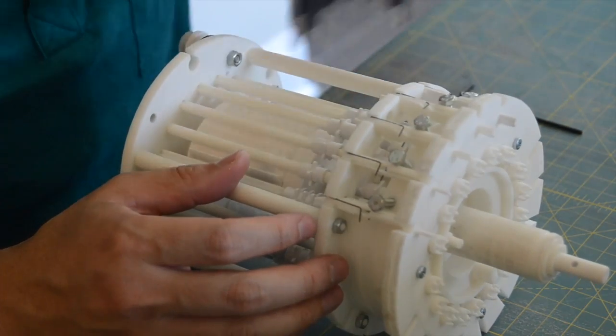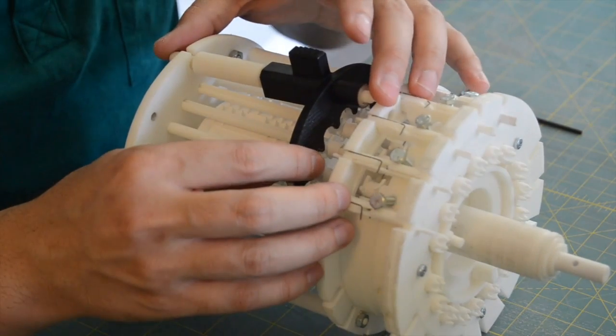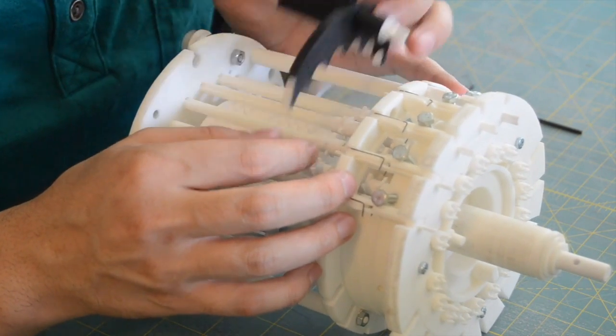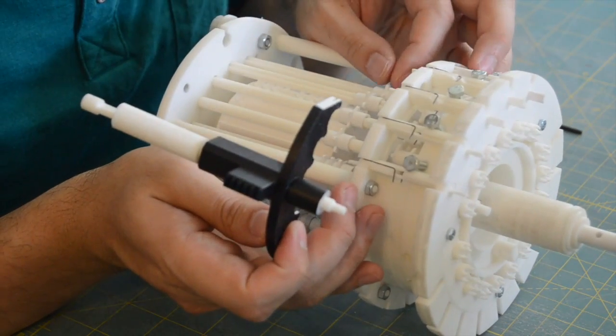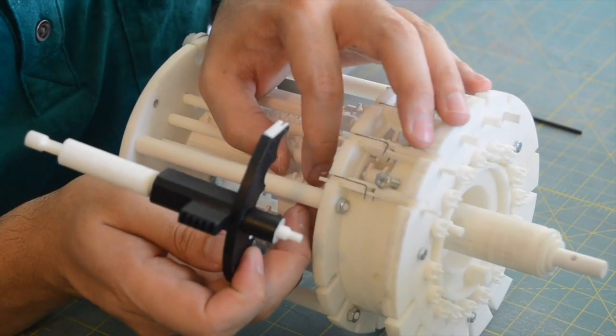Place the reversing lever over the gears so that the notched bottom section drops into the slot on the bearing plate. The top of the reversing lever should position under the edge of the main casting and slide up through the hole there. It may be necessary to pull the shaft down inside the reversing lever knob to fit the top of the shaft under the main casting.